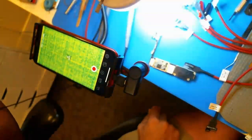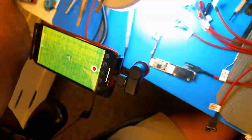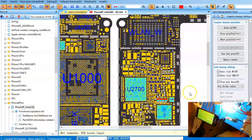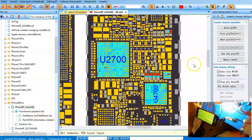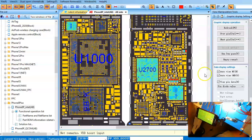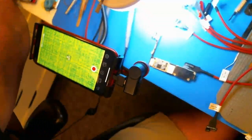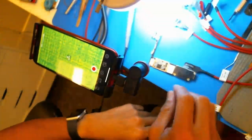After that I disassembled the logic board and brought up ZXW tools. I know where VDD boost is, and usually it's one of these caps up here — typically one of these five caps in that area. This is on the back of the logic board — the PMIC and the audio IC. So I immediately targeted the back of the logic board for where the short is going to be.